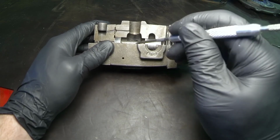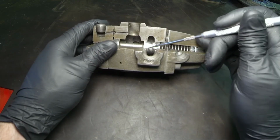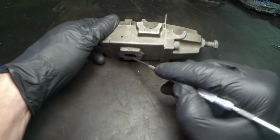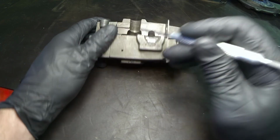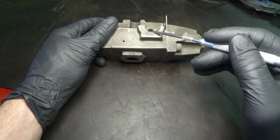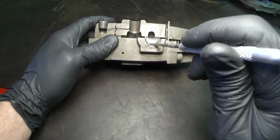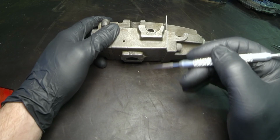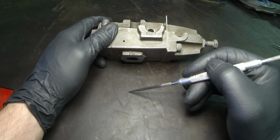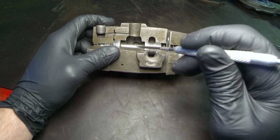So the first function's always going to work first, and then you're setting the pressure at which the second function works. So if you wanted to squeeze, let's say, the cylinder at 1,000 PSI before you started another thing moving, and you want both of them to reach full system pressure, then this is the ideal system to use. If you want to control the order at which things happen and then also want to reduce the pressure in this passage, you would have to add, in addition to this valve, a pressure reducing valve. So it wouldn't inherently do that. It really only works to set the order in which the functions happen.